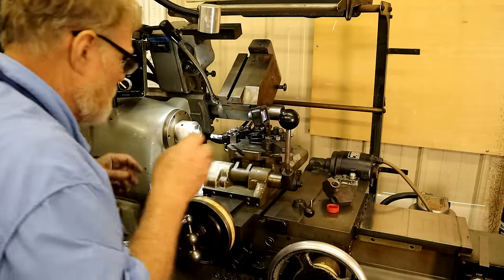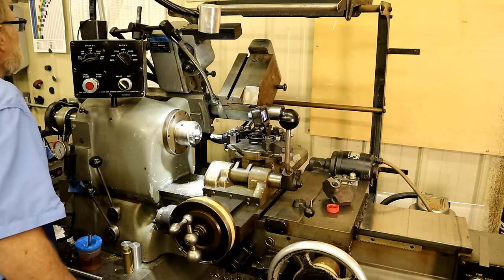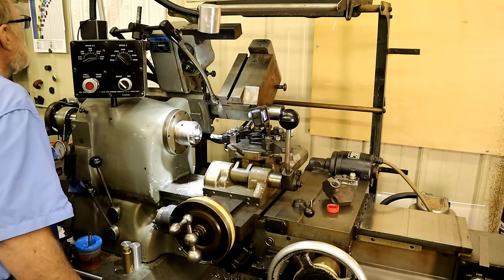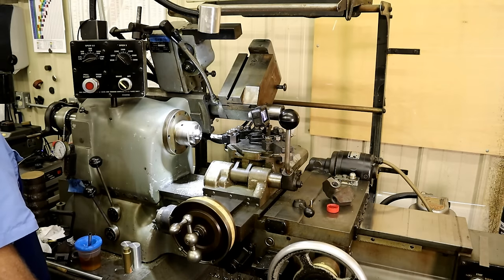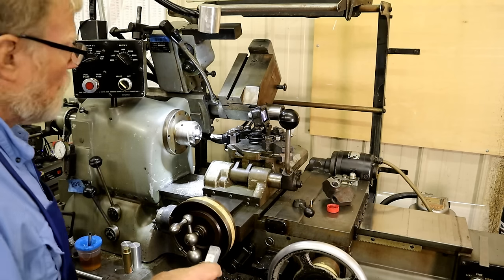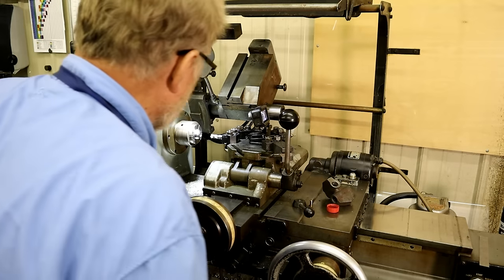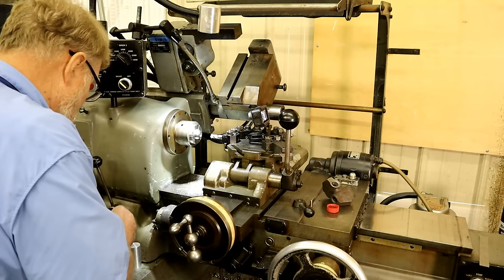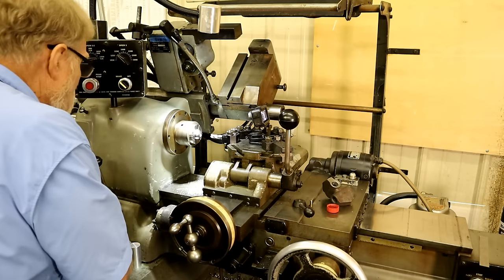Now that mill bit is a 29/64. 29/64, you say? That's 0.4531. What I need to be at is 0.6249. So I got plenty of room to bore. If I could get this to easily take out the center, I'd have a nice hole to start from boring. So, let's continue.